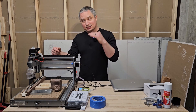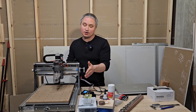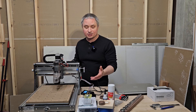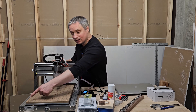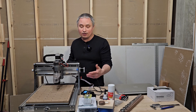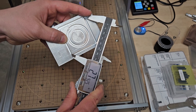One note: with the Y-axis extension, the bed is a little less stable in the Z direction and you can see some flexure when you push on the edges. I didn't notice issues because I was taking very shallow 5-thousandths-of-an-inch depth passes, but if you really need Z stability, cut in the very center of the bed. Squareness of the axes is also critical — if X and Y aren't square, you'll cut ellipses instead of circles. I checked this by running from the origin down each axis and measured no perceptible out-of-square condition. The Genmitsu I received ships perfectly square.